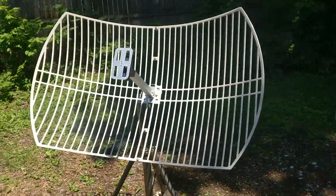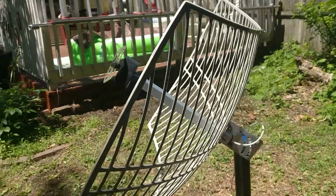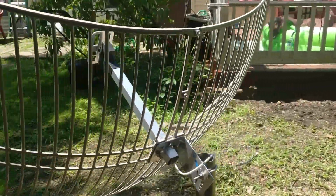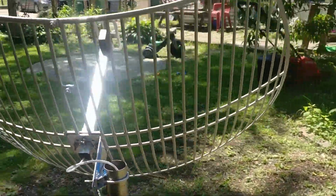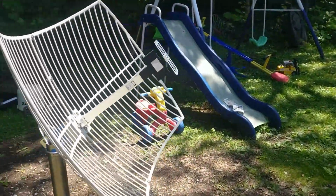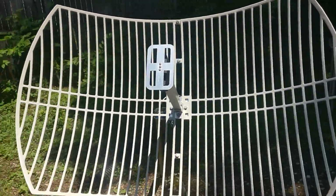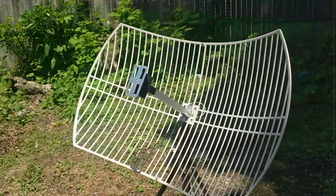The next antenna I'd like to show you today is a prime focus grid antenna. This one, I believe, was tuned for about 1.9 gigahertz, but you can also use the 2.4 gigahertz Wi-Fi grid dishes, and by moving the focal point of the antenna at the end of the boom, you can better tune in various signals, such as those in the L-band at about 1.5 gigahertz.